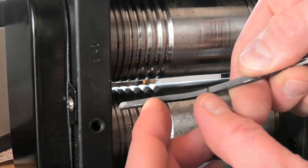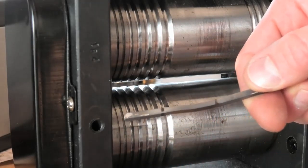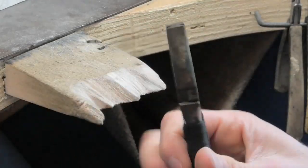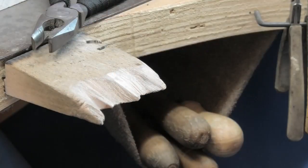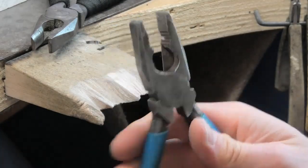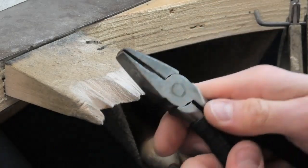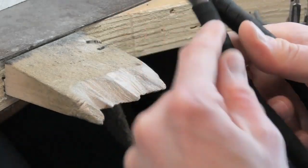You don't need to flatten that section too much, because that section is going to be the shoulder — especially with a big stone, there's a lot of distance across the finger so the shank isn't actually that long. Anneal your bit of metal, then take your large half-round pliers. If you don't have these, because they don't sell them, you should make them. I always say this in my videos: get a big chunky pair of pliers — I bought these from Brick Lane market for about a pound — then using a grinder, grind away, get rid of the teeth on that side, round that off, and make yourself a nice handle. This is just shoelace glued on.